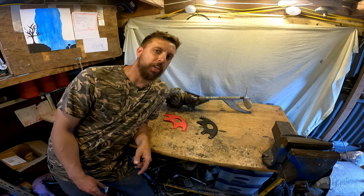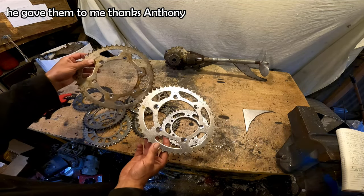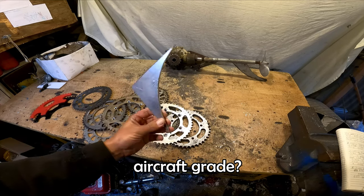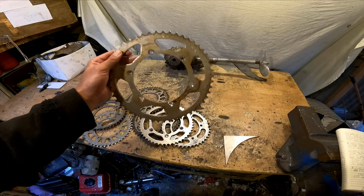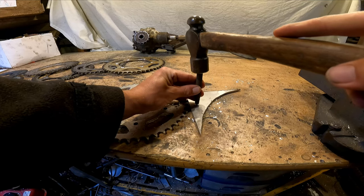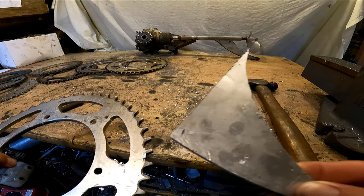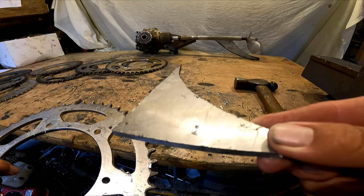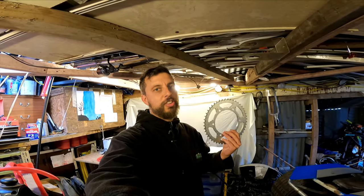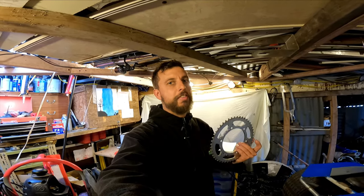Let's answer a few questions before they get asked. A friend of mine used to race Supermoto on an RMZ 450 — he had heaps of different sprockets with different gearing options, some aluminium, some steel. Commercial aluminium sprockets are made out of 6061 grade, while mine is 5005 grade. The biggest sprocket I could find was 51 tooth but I needed 60 tooth to reduce my gearing, that's why I made a custom one. A hardness test shows a center punch went deeper into my sprocket than the commercial one, so mine won't last as long — but with the load spread over 60 teeth I think it'll have a fighting chance of lasting a while.